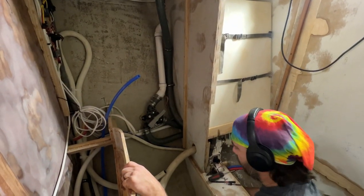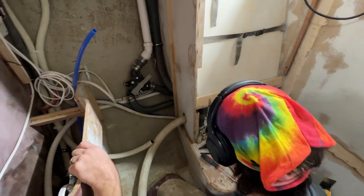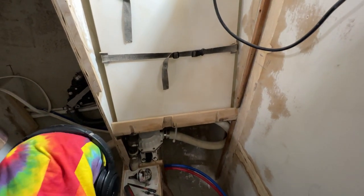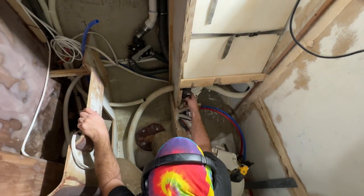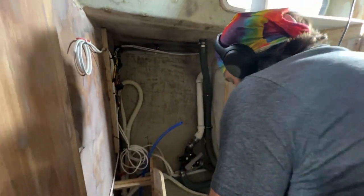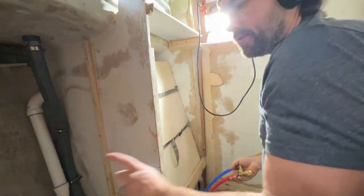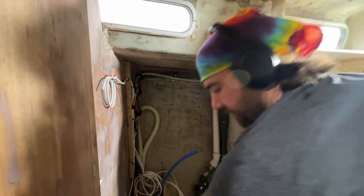There's a main through-hole for the tank drain that opens and closes. When it's closed, this fills up, and then when we have the opportunity to empty it, we'll just pull that open — it dumps right into the ocean, gravity fed because the water line is right below the tank. There's also this little T which goes up and out to the deck for pump out. Then there's also hot and cold for the shower that'll live up here, and just cold water supply for the sink. The shower drain will be installed when we put in the flooring, and the sink drain lid is right here.